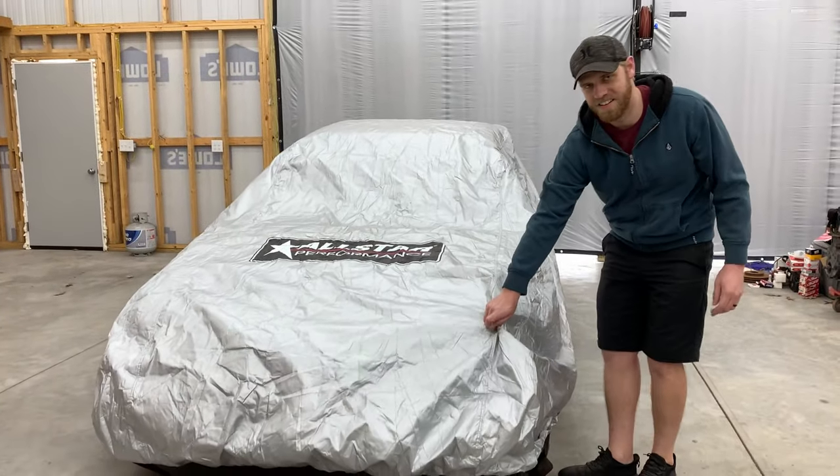The day has finally come — we're about to unveil Stage Fright's brand new look. I've been super excited about this; it's been really tough keeping it a secret. Action Graphics has this thing looking awesome. We've been having a lot of trouble with the paint, which caused us to take a lot more time on this than expected. It's been way too cold and humid — there's been a couple days where I've walked out here and there's literally been moisture dripping from the roof of the shop. I wish I would have just taken the time to go buy the water separator like I needed to and gun paint it like I'd planned. Instead I tried to spray paint it and it ended up taking a lot of time and wasn't worth it in the end. Learn from that lesson — take time, do it right the first time. We've sanded the car, stripped it, repainted it. Still got a couple spots that aren't looking great, but after the paint cures I'm going to try to polish it out. The moment I've been waiting for for weeks — give us the countdown: three, two, one.